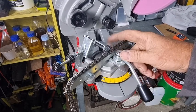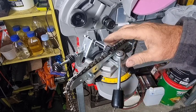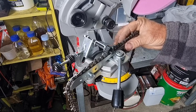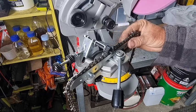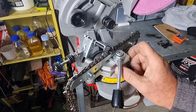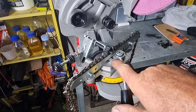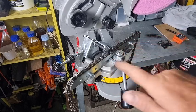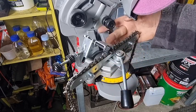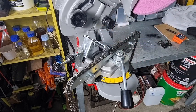The other thing on this clamping mechanism is you've got this little plate here - you'll see I've loosened it - and both of the rails. They call it self-centering, so not just one side: it clamps up both sides because this pulls the other rail. You've got another cam on this side plus this cam - so you've got two cams. The bottom cam pulls the rail closest to my finger, and this side locks that rail. So it's a self-centering clamping mechanism.